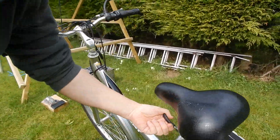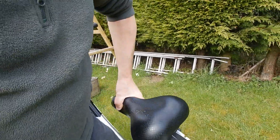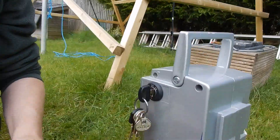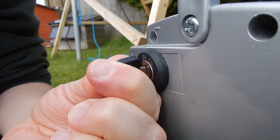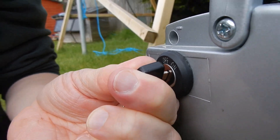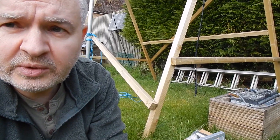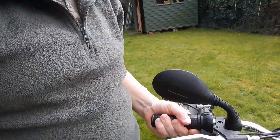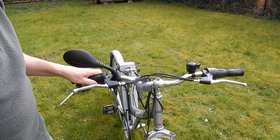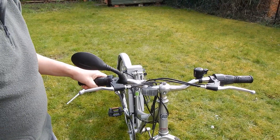Let's get the saddle off because until you get the saddle off, you can't. It's a bit tricky doing this one-handed. If I listen out for a telltale click when I turn the key on — yeah, you can hear the click there. That at least means there's some juice in the battery still. So let's put it on the bike and see if I can spin the wheels. If I turn the throttle here and watch the back wheel — yep, that's still got juice in it, so that's fine.